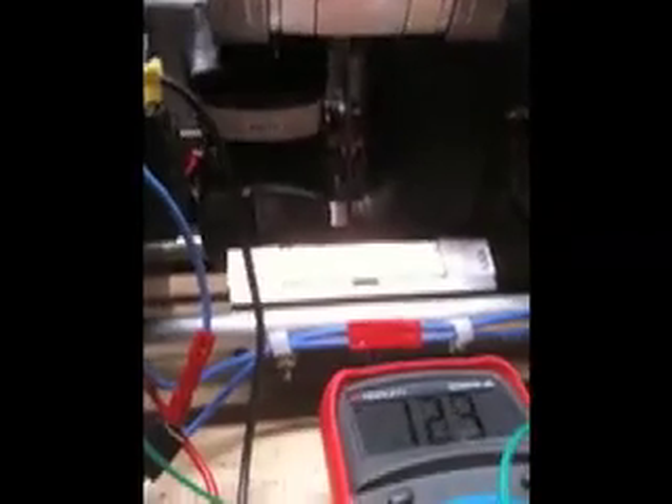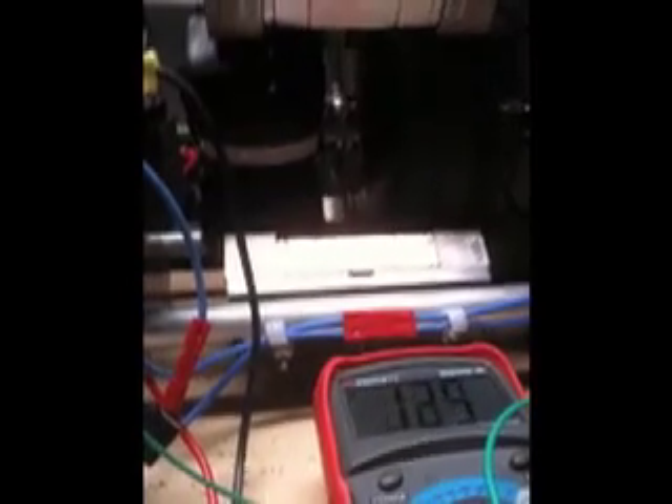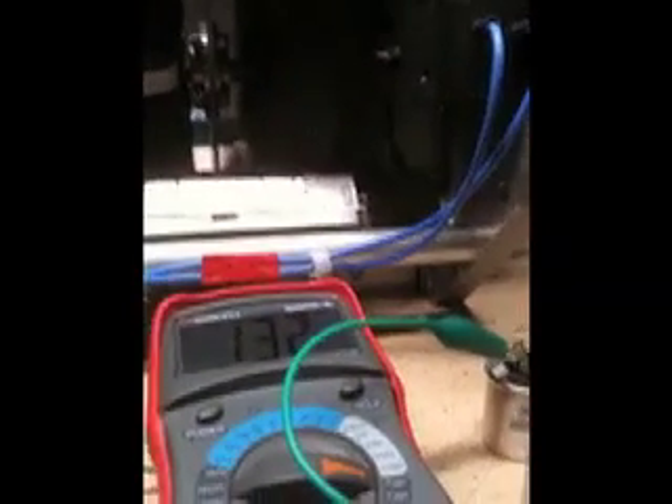Watch the AC volts — what happens. If I move it just partially, we see an increase in voltage, and I am not spinning that second armature. If I move it a little bit more, it'll drop off. If I put it back in phase, which is just centered, you see 87 volts. Now I'm going to move it partially into phase — you see 129 to 130 volts. So the secondary winding, even though it is not spinning, definitely adds to the voltage. The potential difference is there. What we're seeing is probably just like an automatic type of bucking and collapsing magnetic field because it's being pulsed unilaterally from this armature. I have not done any testing with the second armature spinning yet — I just want to see what this thing is doing with one. So at 1.5 amps in, 132 volts out.